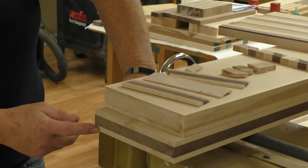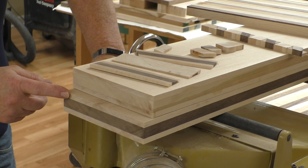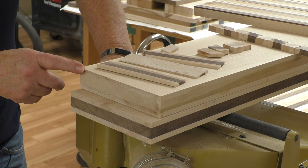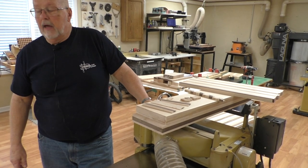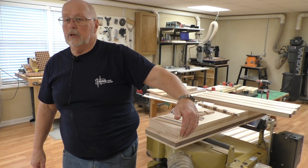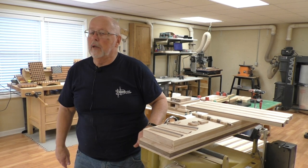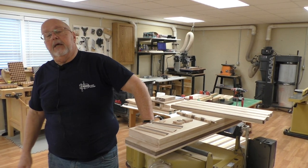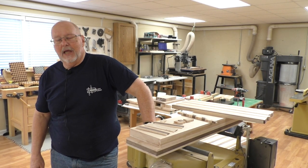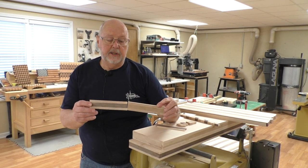The key for making the 3D cutting boards is your original glue-up — you're making sandwiches. You have a three-eighths inch thick piece of hard maple, three-quarters inch cherry, and another three-eighths inch hard maple, all glued up. Once the glue is dry, run one edge through the jointer to clean it up, then rip them to the same width on the table saw. Here are your two sandwiches that you start out with.